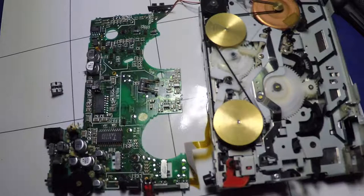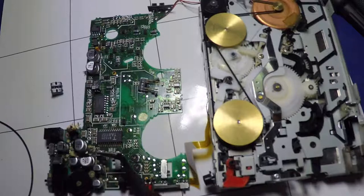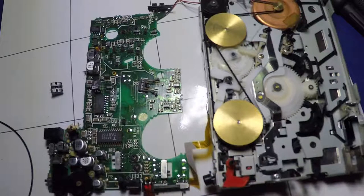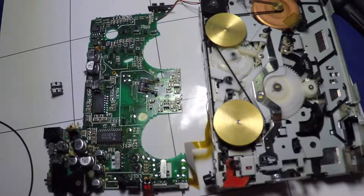When I got this one off eBay it said that it wasn't responding to the play button, so I knew I had to take it apart. While I've got it apart, all these various capacitors of different values are going to have to be replaced. There are actually only about three different values: 220 at 4 volts, 100 at 2 volts, and 220 at 2 volts. Some of those are already on their way and I'll replace them before I put it back together.